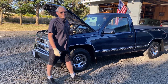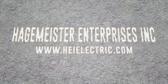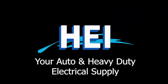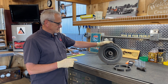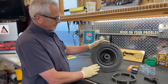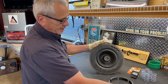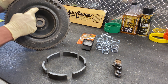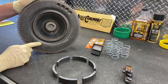Got a new project going on in the shop and a different kind of charging system I wanted to show you. Larry at Hagemeisters wanted to show you what we're working on today. This is a flywheel out of an Onan engine and the magnets have just blown up in it. The customer brought this to us and the magnets are just disintegrated. That is the charging system for this Onan — it happens to be on a welder. I wanted to show you the new magnets and how we're putting those in there.